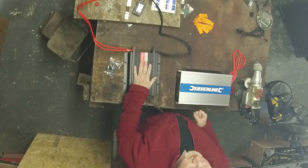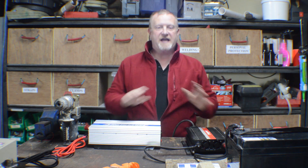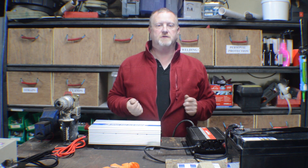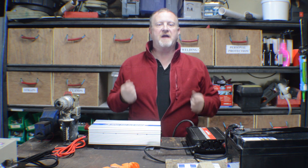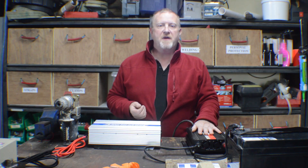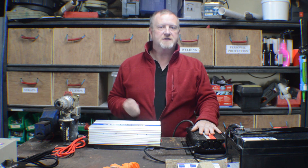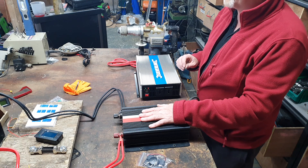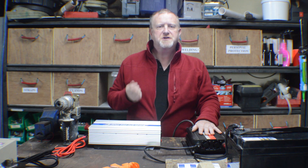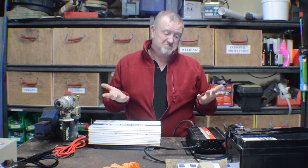This is a 620-watt drill on a 1000-watt inverter. I always maintain a 75% error factor — what I mean is, if I calculate the power of all items in the camper van that we're going to use, I want to make sure we never really use more than 75% of available power. This inverter is 1000 watts, so I never want to put a load of more than 750 watts on it. They say it's rated for a one-second surge of 2000 watts, which is useful because most electric motors draw a lot of power on startup and much less once spinning.